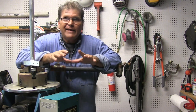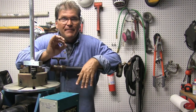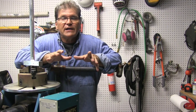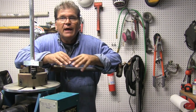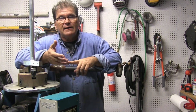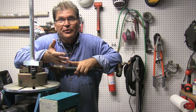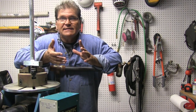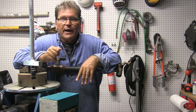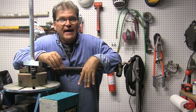I'm going to be using a slightly underpowered welder today, but I'm going to be adding helium to the argon, and it makes it just enough. It's a TIG 175 square wave made by Lincoln — a transformer machine, not an inverter, so it doesn't have any bells and whistles, no adjustments for frequency or AC balance or any of that stuff. But by adding helium, it's like it turns it into a whole other machine — just enough power to melt this right away and not have to wait around for a puddle like you do sometimes when you don't have helium and you don't have enough amps.